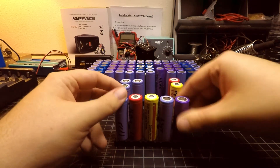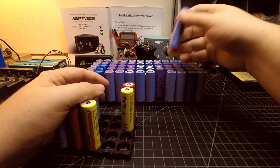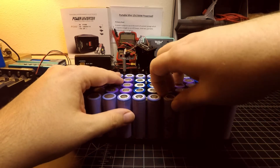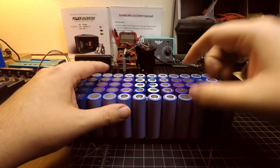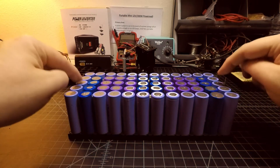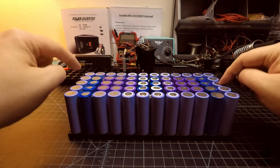With that said, I now have this battery pack fully ready to go with all 60 cells. I'm using 40 of the Samsung cells that came out of the 36-volt eBay packs, 18 of the purple no-name cells from that Chinese-produced pack from Amazon, and then two cells which came out of the Dell laptop — these tested out at about 1,820 or 1,840 mAh.